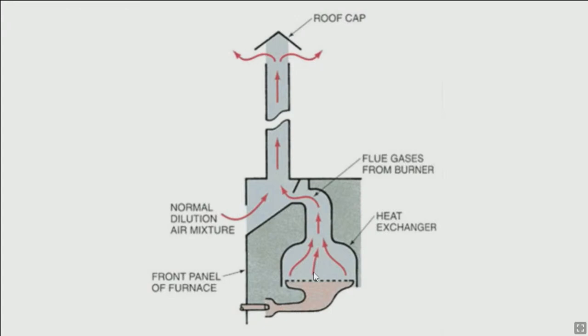If it's a multiple burner piece of equipment, such as what you're showing here, let's say this has three burners, you've got to test each individual heat exchanger outlet. One of the number one mistakes that guys make, and I've done this myself, is we will test in the flue in this application. We think that testing in the flue is where we test everywhere. But if there's a draft hood or a draft regulator, you are measuring a diluted flue gas sample. It's a mixture of room air and flue gas, and it's not a true sample of the flue gas.